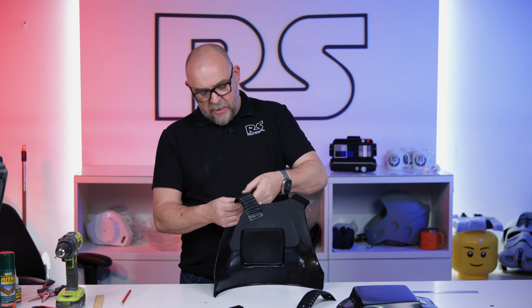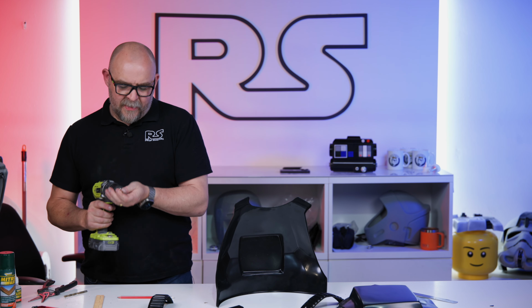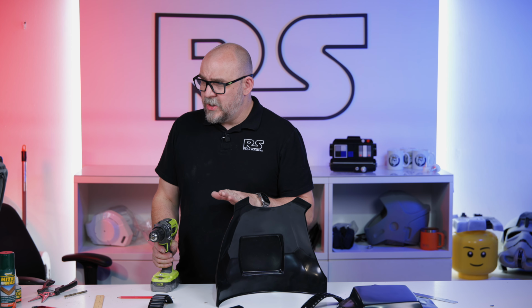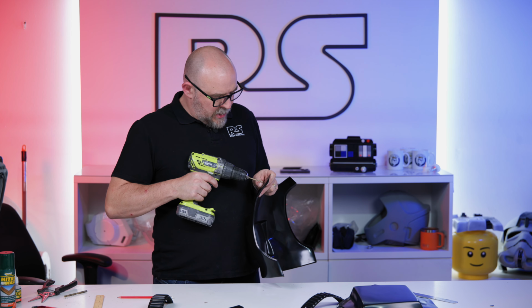So we'll take our piece. I want it about 1 inch, an inch down there. And roughly central. I'm just looking, using my eyes. So I'll go in with the 4mm again. If when I see it, I look at it and I think it's slightly off center or I want to change it, I've kind of got another 2mm where I can correct it a little. And it's just not a savage pulling through, you know.